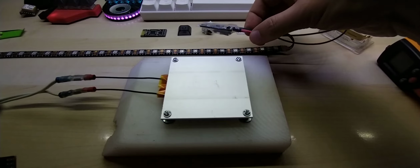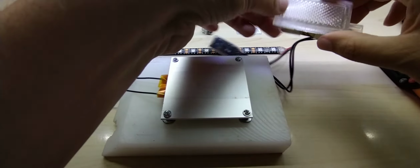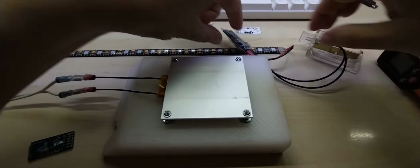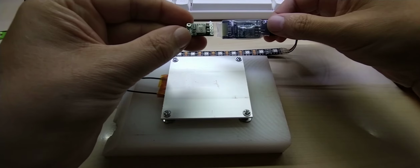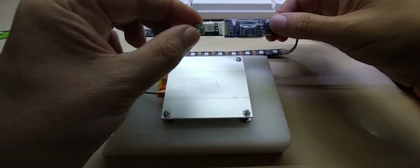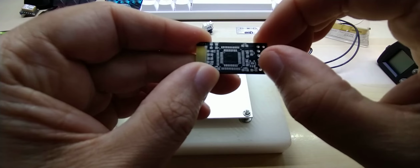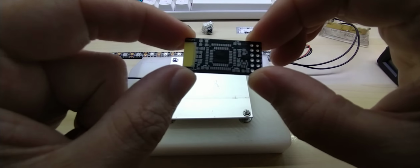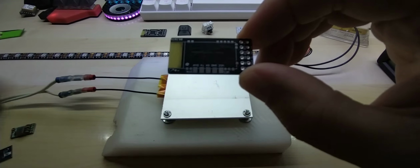This is actually the passenger side, which I still did not install yet, and I can also show you this is the actual light that I have in the door on the bottom that I took out because I had to solder the wire. So this is where I get the 12 volt from, and this board also has 4 pins that I can solder a DC-DC converter to that brings the 12 volt down to 5 volt, and the PCB itself has also a 3.3 volt regulator LDO on it to run the chip at 3.3 volt, and especially the Bluetooth module, because that one can only take 3.3 volts, because this is a bare one.